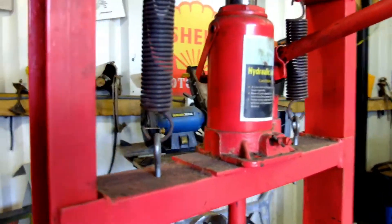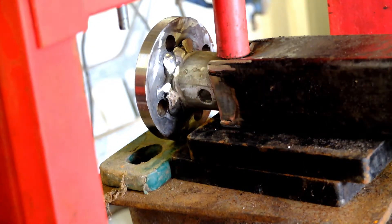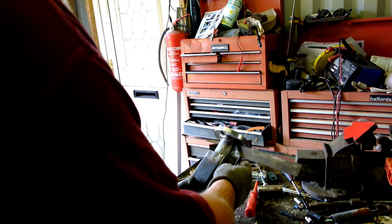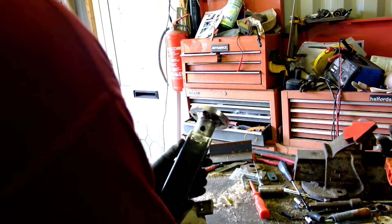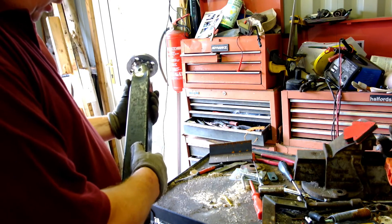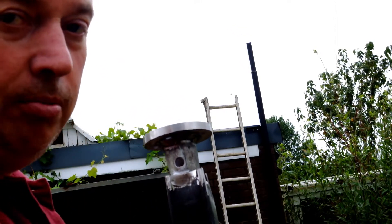Crushing the ends of the sleeve onto the pipe, then I can weld it on permanently. Once you're happy that the sleeve is squashed in and the pipe is sitting square, I will put it on the pole. Double check — make sure the sleeve is on okay. I think I'll drill two holes here so I can put a bolt through it. We're going to put the sleeve now on top of our pole, make sure it's okay before we actually weld it on, and make sure we've got enough height.